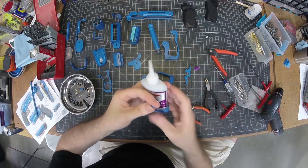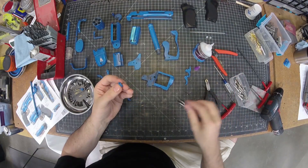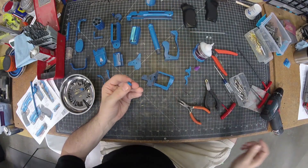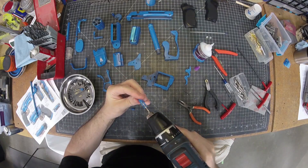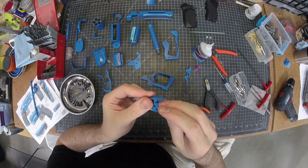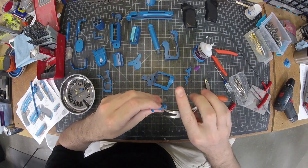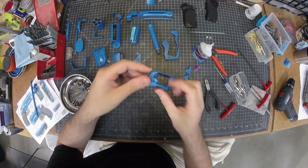For this I'm going to put a tiny bit of glue, put my spring in there — these springs have a habit of running away — and then I've got a little bit of super glue activator to just tack that down. The hole in the other piece needs to be the same diameter. So now this tiny spring can go in that hole and our pin can go through there — just enough force from that spring to hold that pin in, very very weak.